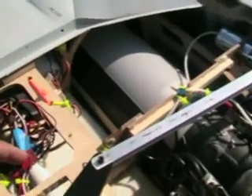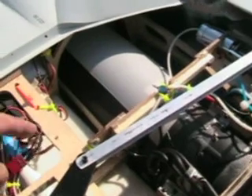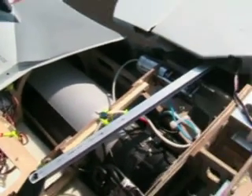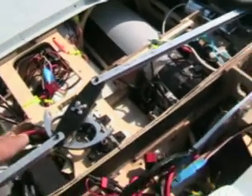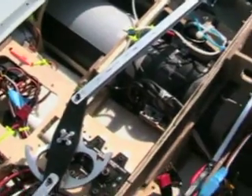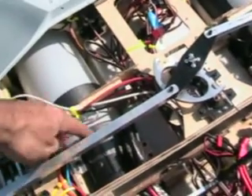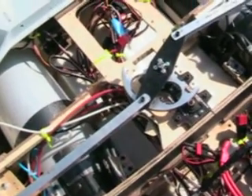Wing sweep I also have set up on its own separate power supply. The XPS guys started talking about that and it made a lot of sense. If this binds up and even drains its battery down completely, its power supply is totally separate from the rest of the radio system. The radio system has two separate power supplies going to it. The XPS fan works wonderfully, putting out a lot of power. I'll put all the data on power consumption and that stuff online.